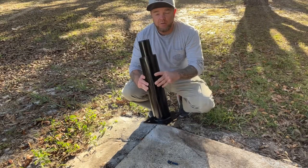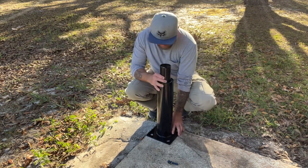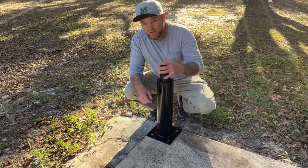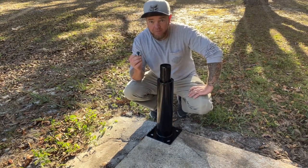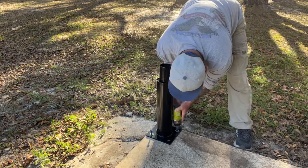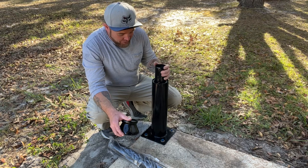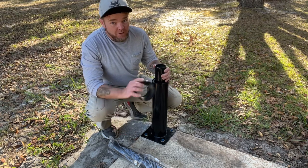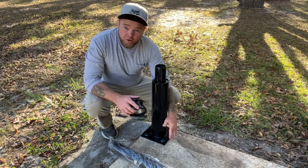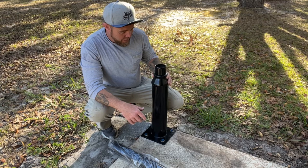The next step is very easy. Take your mounting base, set it exactly where you marked your holes, and grab your hardware. If you're using the provided hardware, hammer those sleeve bolts in and stick the pole on top. Since I'm using three-eighths tapcon anchors, I'm going to set the base down and drill these into place. And that is not going anywhere. Tapcon anchors are 20% stronger than sleeve bolts — very next step, get your collar and slide it right on.